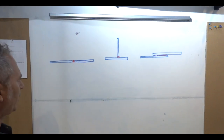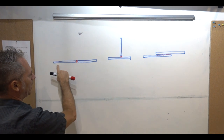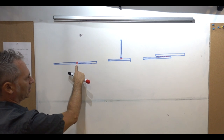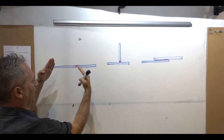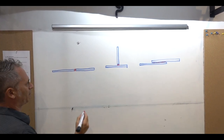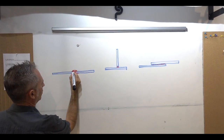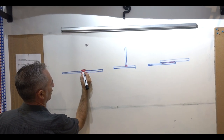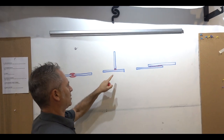Let's have a quick look at types of glue joints and what works best, going from the worst to the best. The worst case is where you have one piece of thin sheet and you try to join it to the edge of another thin sheet — you have very little surface area and a lot of leverage to break it. It's a pretty bad joint. If you wanted to accomplish this better, you'd want the glue to create a mechanical grip around it.